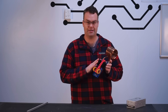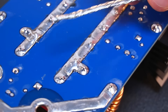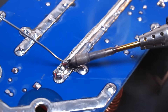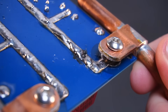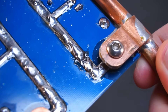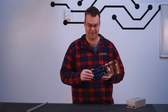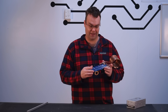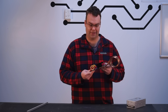If you plan on building this induction heater and powering it with more than about a kilowatt, I would recommend soldering some bare copper wire to the traces that connect the caps to the coil. When I was powering mine at 1.4 kilowatts, one of the traces began to melt the solder — when the solder dripped away it left the trace exposed and it burnt out, resulting in a damaged MOSFET. Soldering some heavy gauge wire on top of the traces should avoid this happening to you.